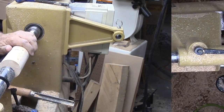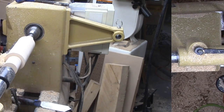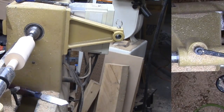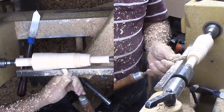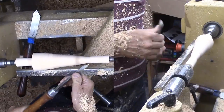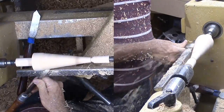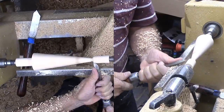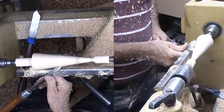With that tenon done, I'm moving to the other end and marking 6 inches from the base. Then I'm parting to mark my place before wasting away most of the excess. With the top and bottom marked, I can start forming the cone. This cedar is soft enough that peel cuts with a skew work very nicely. I peel with the skew almost at a tangent to the work, then arc toward the center taking little bits at a time.